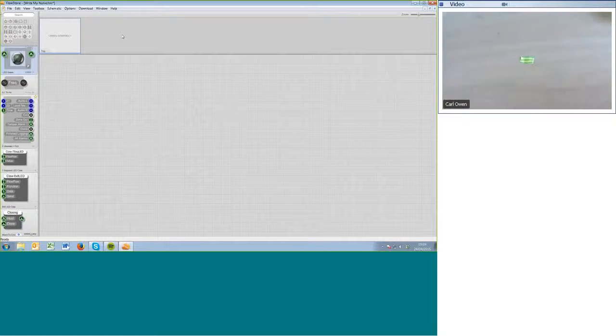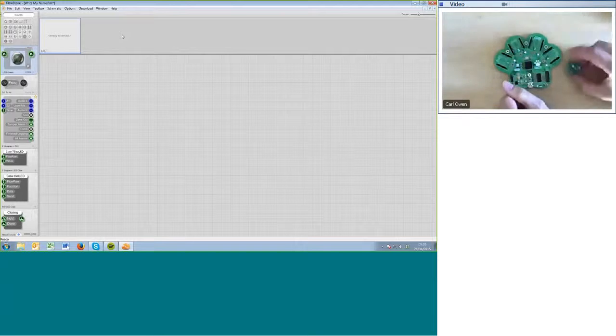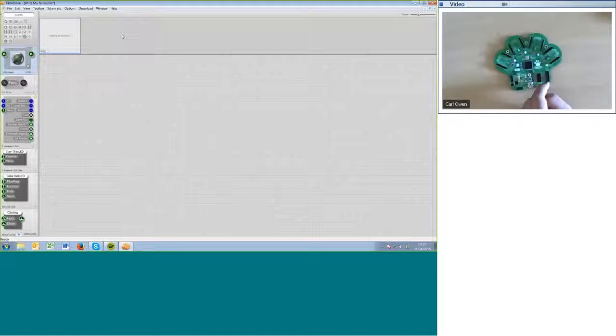Now let's look at how we connect the whole thing up. If we look at the FlowPaw board, let's see what's actually on it. It's shaped a bit like a bear's paw, and that's where the name comes from. On here there are 4 what we call claws, which are sockets for plug-in boards, like the little clickboards you've seen. In addition, on the right-hand side, there are 8 servo outputs, so you can control remote control servos, and also motors to drive wheels and that kind of thing.